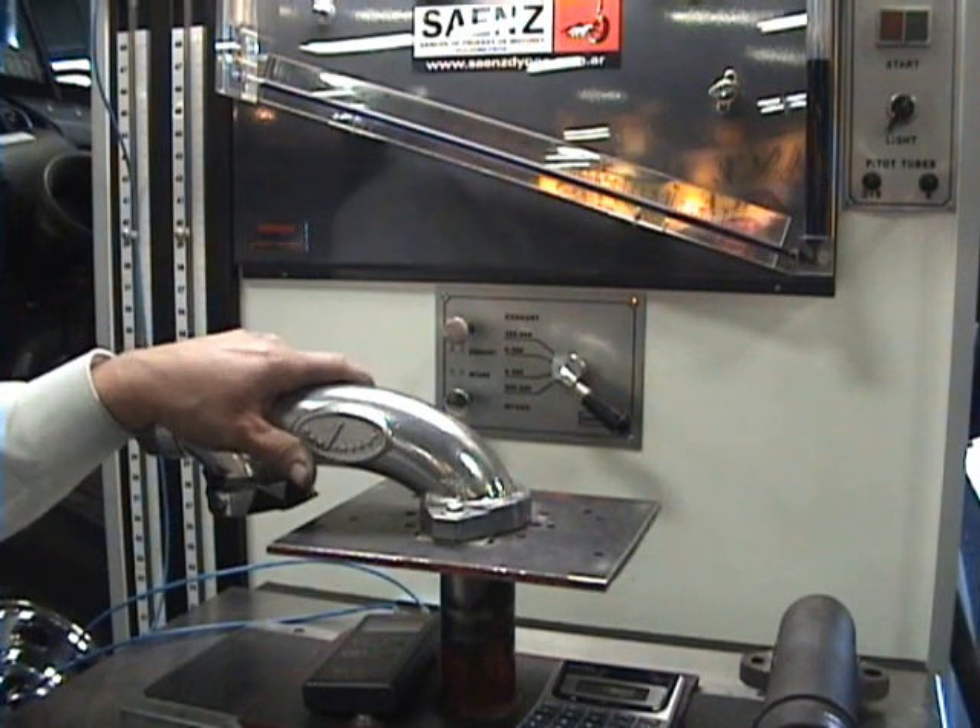So you're getting the exhaust out of the combustion chamber faster. The ceramic coating is keeping the exhaust hot until it gets to the turbo and you can get higher efficiency out of the turbo. And then you're moving more air, which is again more efficiency.